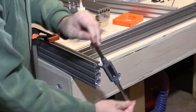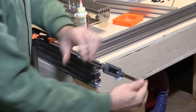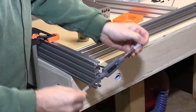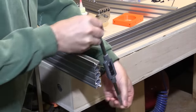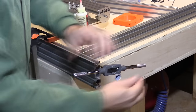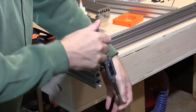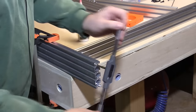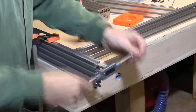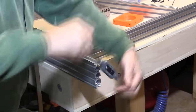Once it starts to bite — and you'll feel it — go until you feel it maybe four or five turns and it will be starting to get tighter on you. Once you get to that point, start taking a turn and then back it off a little bit and you'll feel the cutting get easier. You'll also occasionally hear it crack as the pieces of metal break off. Just keep doing that — a full turn, give it a half turn back, give it a full turn, half turn back.